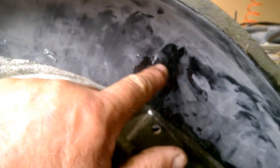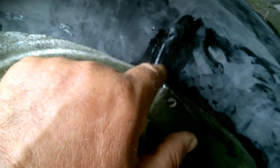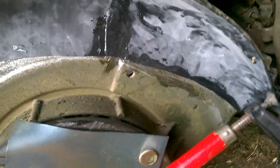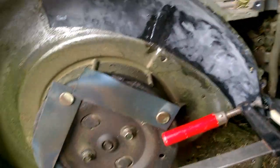I also just used a bit of the sealant across there and just smeared it across. Still quite wet, of course. I ended up using storm water sealant, so for guttering and that sort of thing. So I thought, well, that sticks like the proverbial, so we'll give it a go. Also ran a little bit of a bead around the edge of that as well, as you can see. Anyway, I'll trim him up and show you the finished product.